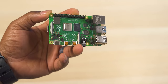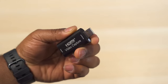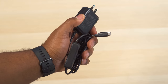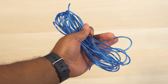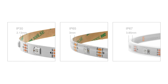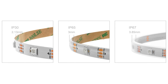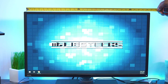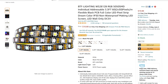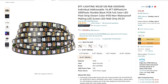The required parts include a Raspberry Pi — I recommend the Pi 4 or Pi 3 — a 5-volt power supply, an HDMI to USB grabber, an HDMI splitter, a USB power adapter for the Pi, some jumper wires, electrical wire, an SD card, and WS2812B individually addressable LED strips. The LED strips come with different levels of water resistance; I usually recommend IP30 since most people don't need it, but IP65 works fine too. Measure all the way around your screen to know how long a strip you need — most TVs need a 16-foot strip, and projector screens may need two.